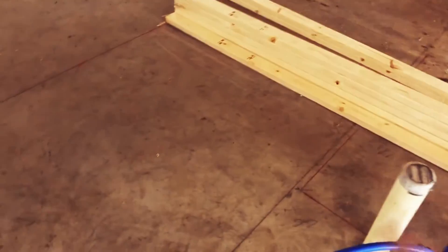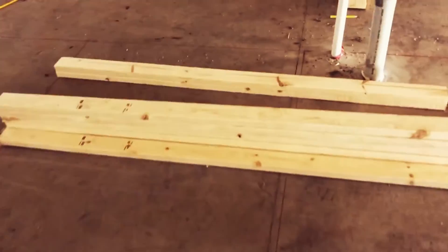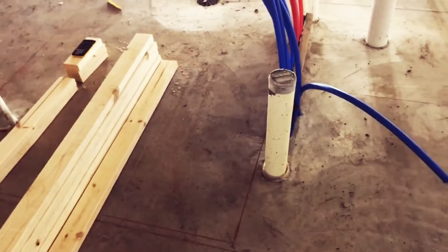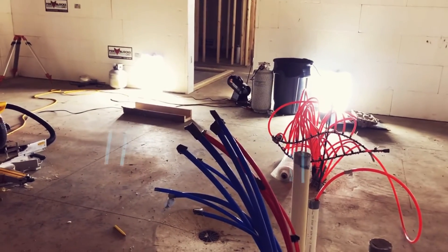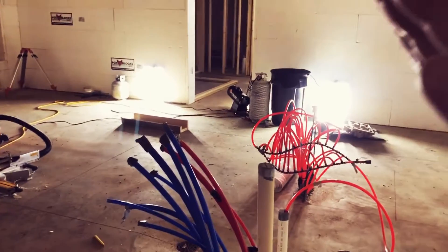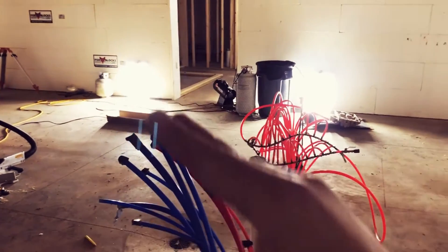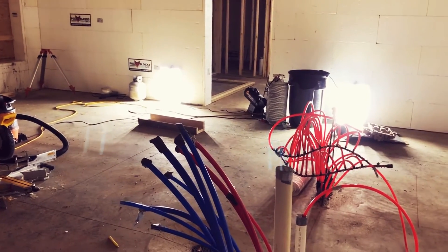I think what most people do is lay out a template on the floor, so I'm looking for a space big enough to lay out a full-size template and start framing up these rake walls — there's quite a few of them. There's a full-size one from the edge of the utility room to the front door, then a handful of little half-ones. I'm also not 100% sure how to handle the angled top plate on walls perpendicular to the rake wall. If you think about stacking 2x4s for the top plate and double top plate, they come off at an angle — so do you offset them so they're roughly straight? But then drywall can't butt straight up against that — you'd need to bevel it. So I've got to look into that.